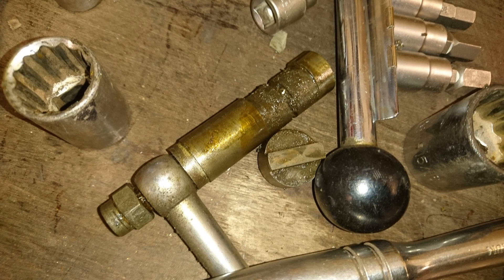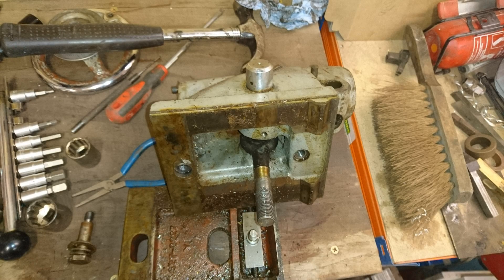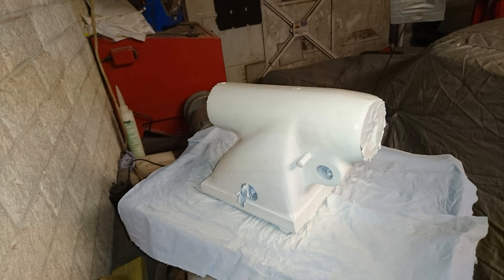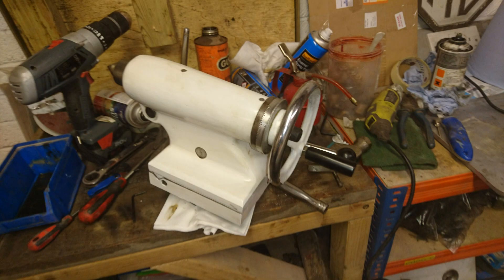This here is the tailstock that I'm stripping down. It works on a cam. Just like all my other things that I restore — strip it down, a light coat of filler just to fill in any minor defects, and then go with the enamel paint. You can see the tailstock came out pretty nice. I then worked on the carriage, or the apron, as it's also known.